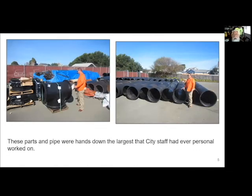Here you can see the pipe. I immediately knew that we wanted TR Flex ductile iron. Basically, Caltrans would only allow either welded steel or ductile. And the reason I went with ductile, I mean, I love welded pipe. I've got a long, long background in welding. In fact, that's what I did the majority of my life prior to getting into water. But the thing I love about ductile is I can teach guys how to assemble the stuff within about 20 minutes with common hand tools. So this was absolutely the way to go, rather than doing a much more costly and time-consuming welded steel pipe.